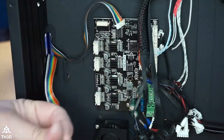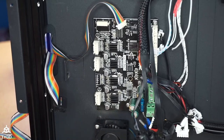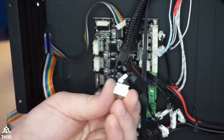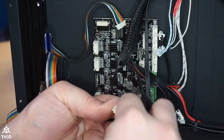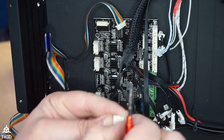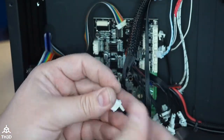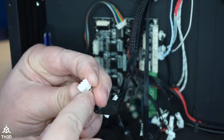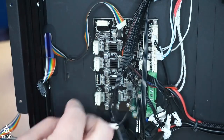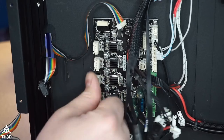All right, so we're going to take the board out. Oh, I just realized you guys noticed the Y header came with it because of the hot snot. There it is. It didn't want to go. Let me pop the hot snot off here. One thing I do sometimes to get the glue off is I take my heat gun on a low temperature and just wave it past all the connectors, and it's enough to soften the glue up where it's easy to get it off, if that makes sense. But if they come off, you can literally just line them back up and press them back on.